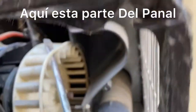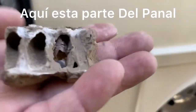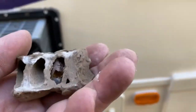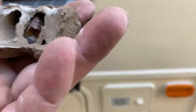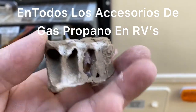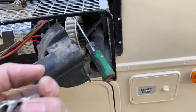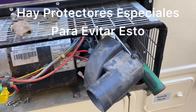They're out and this is what I got out of them — mud daubers, it's really bad. So if you have an LP appliance like refrigerators, furnaces, or the water heater in your RV, make sure to put the mud dauber screens. That will prevent all these issues. They could cause a lot of damage. I'll go ahead and put this back together and show you how it works.